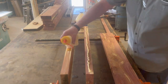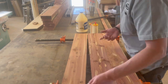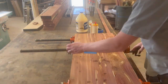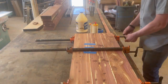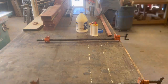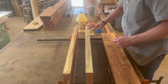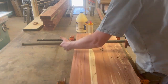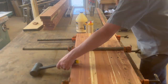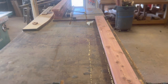Now we've got four panels we're going to glue up. Like I said, this is a simple build — four panels. This is one of the leg panels and they all need to be the same width when you get done. The shelf is a little different: just like the thickness, the width of the shelf I cut slightly thinner — I think I made it a quarter inch thinner than the top and the legs — and that just gives it a little reveal on each side. Also, you'll notice I flipped one of those boards around so I got the white wood on both boards facing each other; it's just a little more visually appealing that way. I always try and pay attention to the grain as much as I can when I'm gluing up these panels.